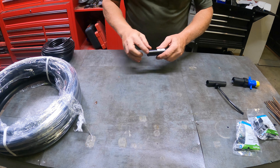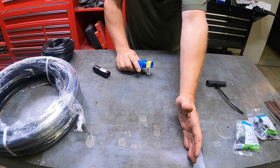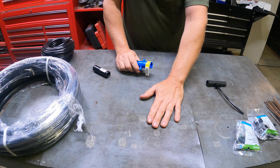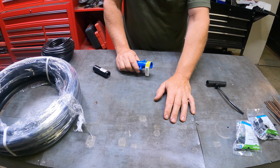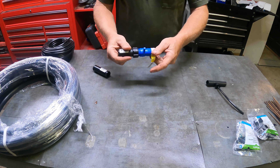So this is the makeup of what I do. I'm going to start at a typical one-inch poly pipe. You can be feeding right off a solenoid. I typically like to have drip irrigation run on its own valve — I don't like to mix it with heads because the pressure can vary so much. I like to keep it on its own zone.